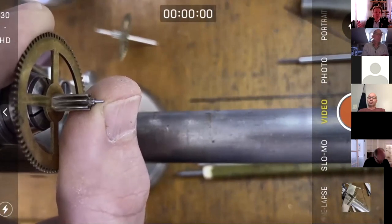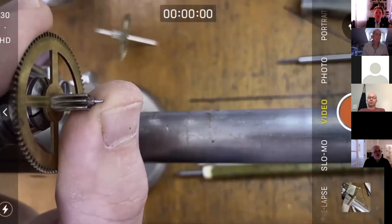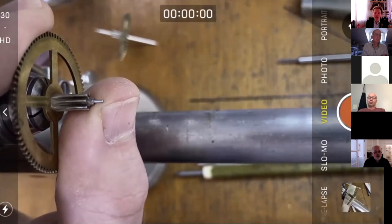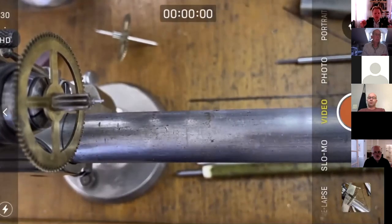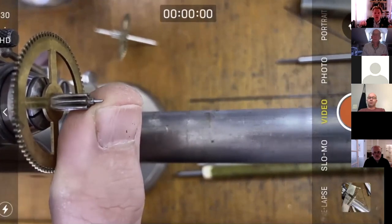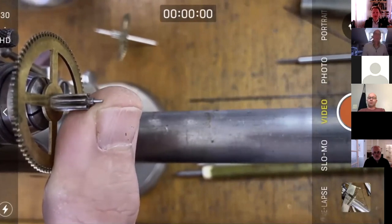Often when you measure a jobber drill or a twist drill, it's actually smaller than what you choose, whether 1/8 inch or 3 millimeters. I think that's probably because they drill oversized, especially these handmade ones, which drill well oversized because you don't always get the point in the middle. So if you look back at last week, Dave, what I did was stone off about 0.03 millimetre with an oil stone before I made the drill, on the basis that the metal would then be a decent fit in the hole. Last week, it didn't work. It was sloppy as anything. This week, it's worked fine.